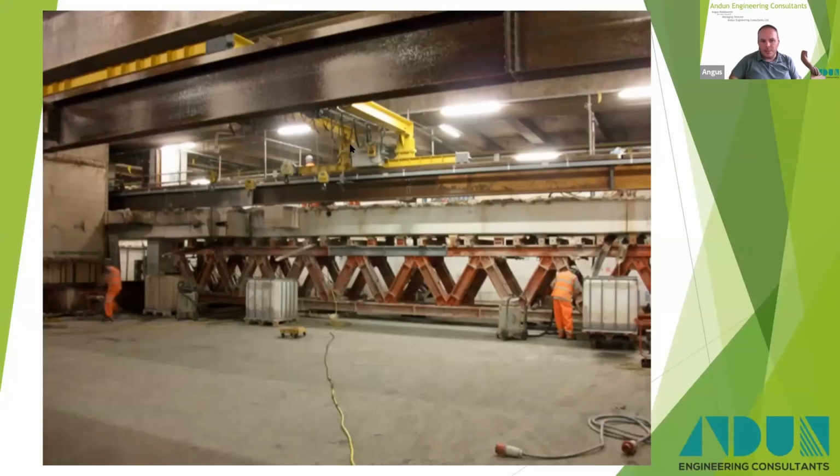Obviously, all the electrics and mechanical side of things is done by the people who specialise in that sort of thing, but the structural design was ours. And then the same with the crane rails, fully designed and detailed, plus the assessment of the structure itself to justify that the loadings weren't increasing on the structure as the demolition was undertaken.